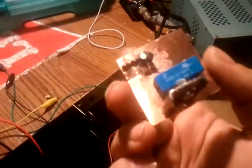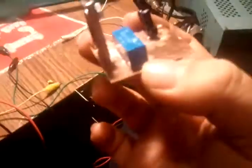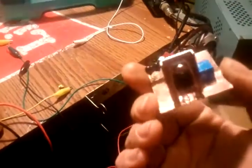And at the end, this LED with a 470 ohm resistor was giving the LED about 1.2 volts. So you put a 1K on one of these LEDs, you ain't gonna see nothing, since this is voltage regulated as well as it is.